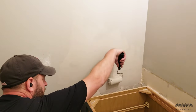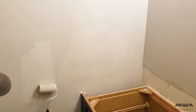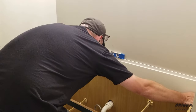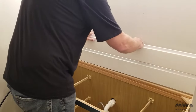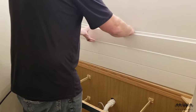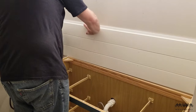I also fixed the damaged drywall by spackling, sanding, and painting over the affected areas. I then added my first run of shiplap, making sure it was nice and level because this board is what everything above it references off of. I'm nailing these in place with an 18-gauge brad nailer. I don't want to add construction adhesive to the back because if I ever want to take this shiplap off, I just want to pry it off without too much damage to the underlying drywall. Each new board sits over the tongue in the previous board to give that nice shiplap look.